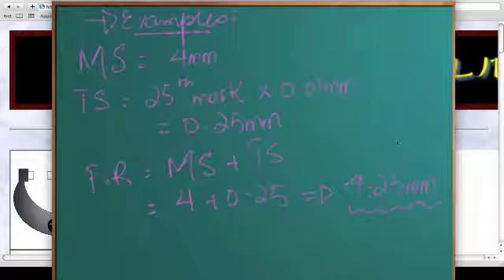We have added a digit of accuracy to our readings. Remember that we can only go to the second decimal place if we are measuring in millimeters. We are still not sure about the third one. So if you are getting a third decimal place by using a micrometer screw gauge, you are definitely doing something wrong or the reading is a little inaccurate. Avoid having a third decimal place, otherwise it would ruin the purpose of the micrometer screw gauge.